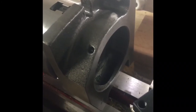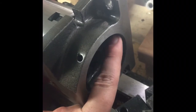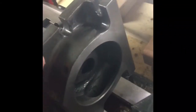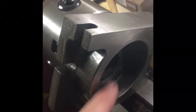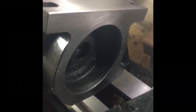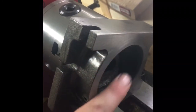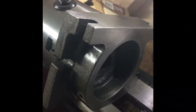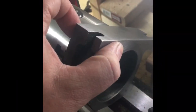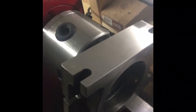What I'm going to do first is bring the parallel in as close to perfect as I can, and also skim the bore to be perfectly concentric with the bearing journal, which is what I'll be registering on with the mandrel. Eventually I'm going to make a sleeve for the table, but that's further down the line. The first step is on the lathe — bringing the parallel and the bore in — and then on the mill I'll be able to make this surface square.